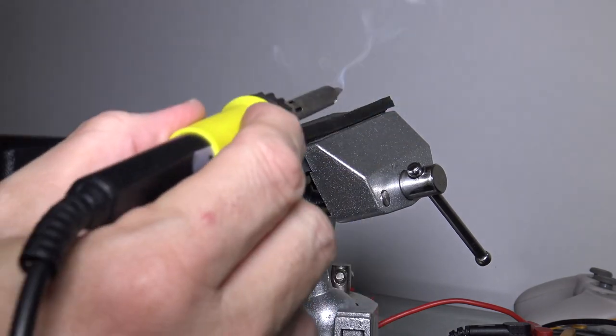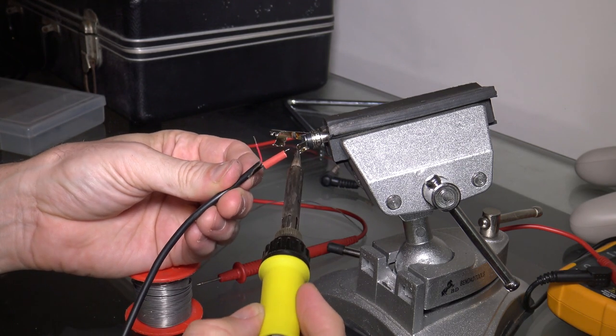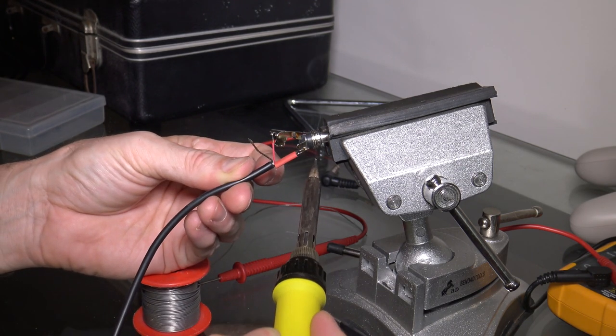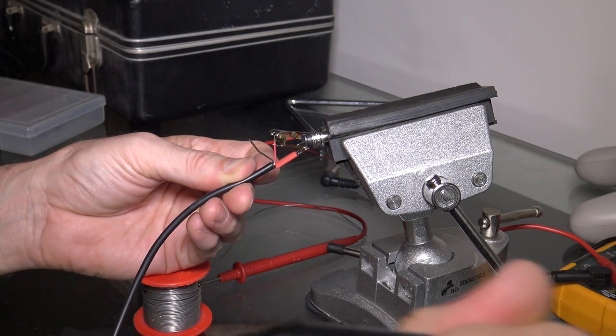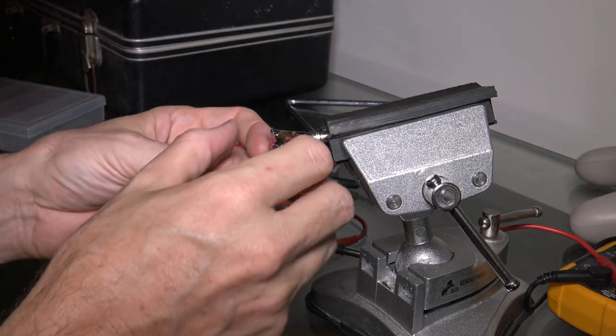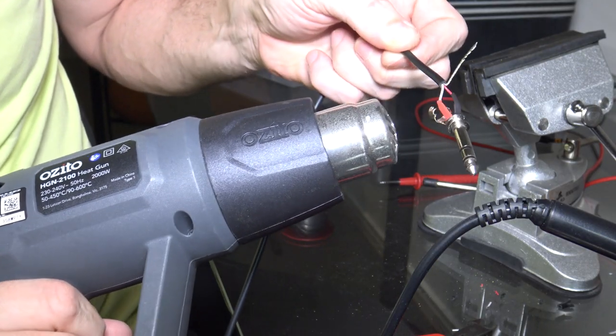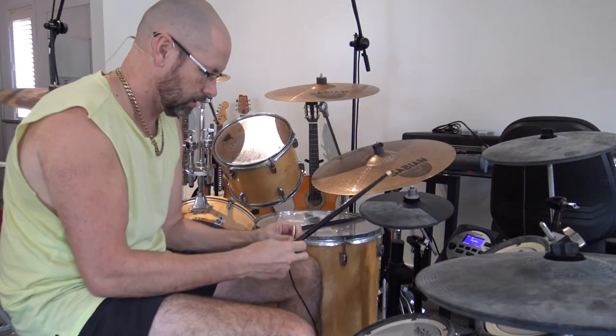Red is the tip and white is the centre. I've tinned the connector — now that both the wire and the connector have solder on already I just heat that up and dab it on, and that's on. The heat shrink will go over and I'll shrink that down around the cable — just like that.